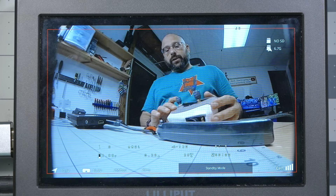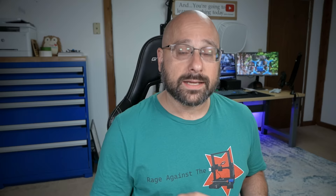The first thing you need to do when you get a new set of goggles, or any time you update the firmware, is unlock the goggles. In the menu where you select channels, you can see that I don't have all eight channels — I only have one, two, three, and eight, not four, five, and six. The reason they do this is that the frequencies used by four, five, and six are restricted in Europe, so they ship them with those frequencies turned off. If you live in Europe, the good-boy thing to do is not unlock the goggles.